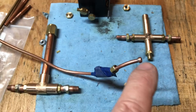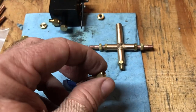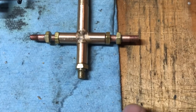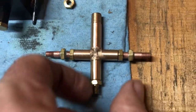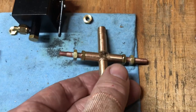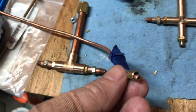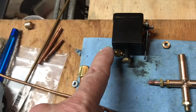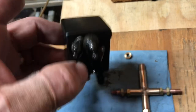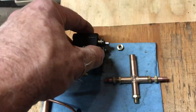A productive little evening in the shop. Here's the cone — the copper cone — silver soldered onto the end of the pipe. The eighth inch copper tubing with the new nut that we just made on there. It fits good. I put a little piece of tape so the nut won't fall off. Also here is the steam intake with the silver soldered nuts on there. I used a little bit less — didn't clog them up as bad as I did on the exhaust. So it came in good. The oil fitting is down there with the ball bearing and the spring in it. That will connect to this, which whenever I make the pipe, it will connect to the bottom of the oil tank. So the next project really is working on the oil tank — I've got to rig up a mounting and then put a little hole with a filler cap in the top. So we'll cover those things next.